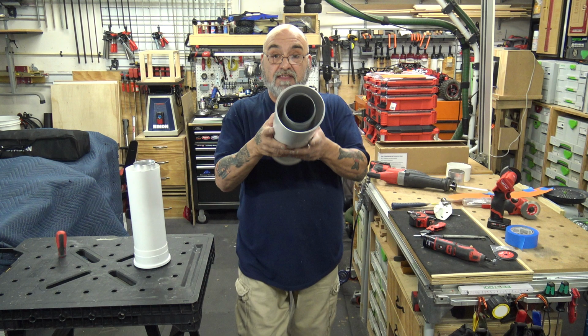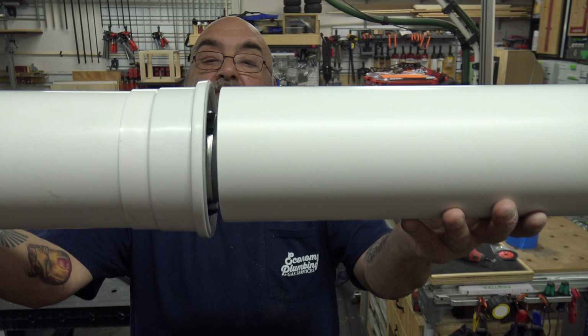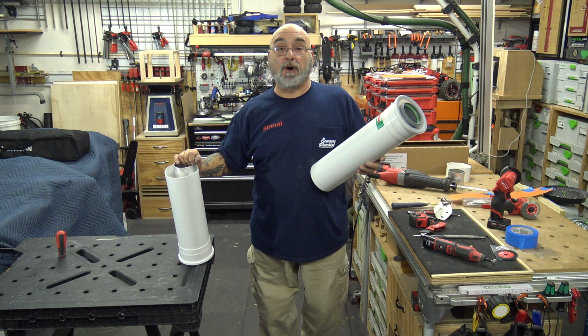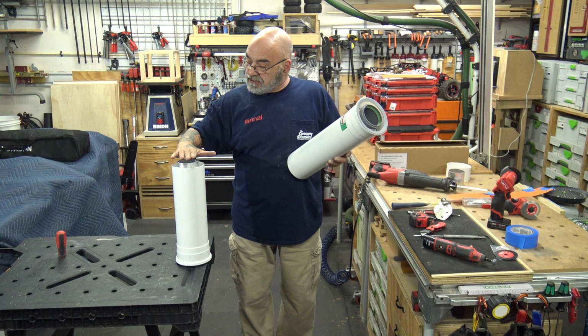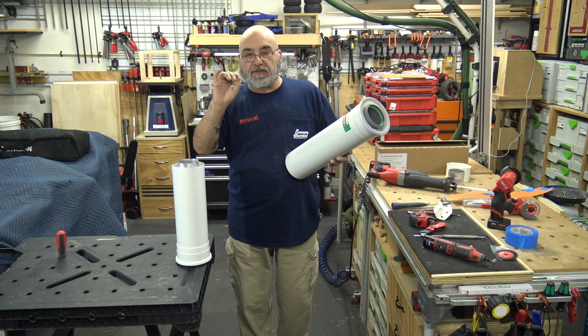It just moves around. So when you're pushing this in, I'm just going to demonstrate. You see how much the center has engaged. But you see how much of the outer is still there? That's why that's got to be a half an inch. It's got to be deburred. It does not have to be perfect. You don't have to be a piano builder. It just has to be a half inch bigger, and it has to be as round as you can get it, and deburred, with nothing sharp on the edges, and it'll work really fine.